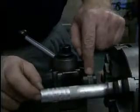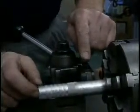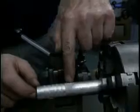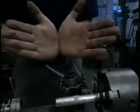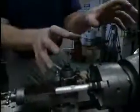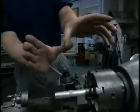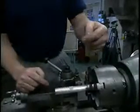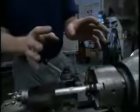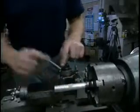And the way to avoid that problem is to plunge quickly enough so that you produce deep grooves during the first revolution, deep enough so you form V's that allow this wheel, even though it's not going to register exactly, to catch the V produced in the first revolution and then fall down in place. And after several more revolutions, some averaging takes place so that the wheel produces uniformly spaced grooves around the part.